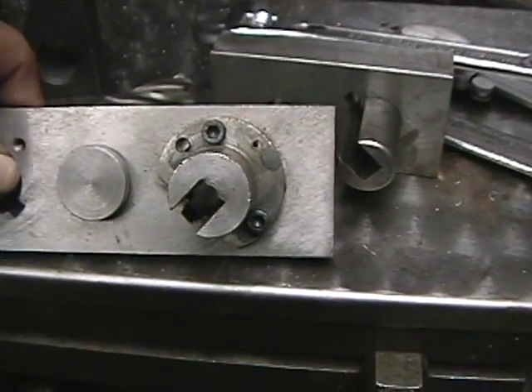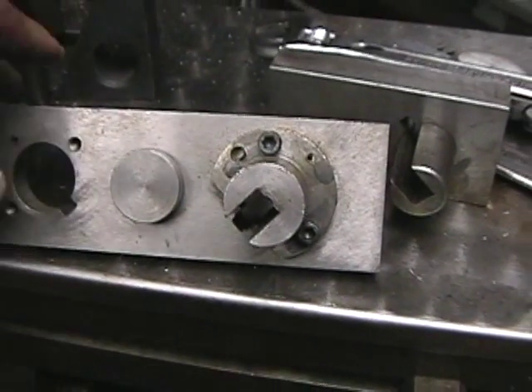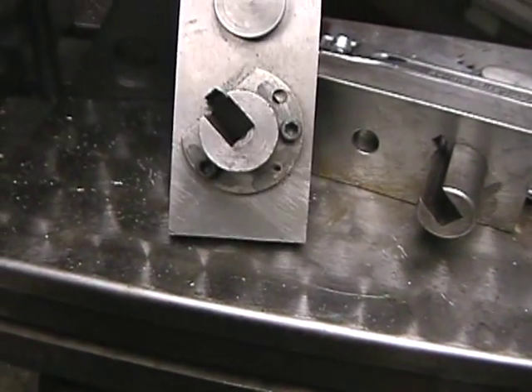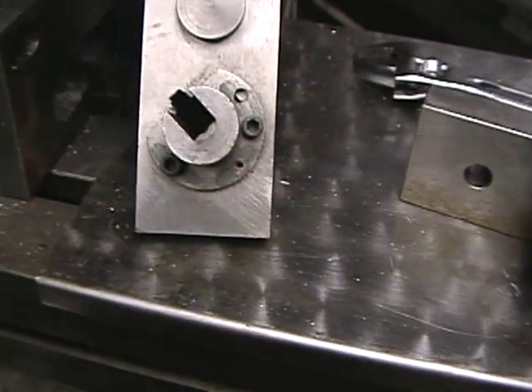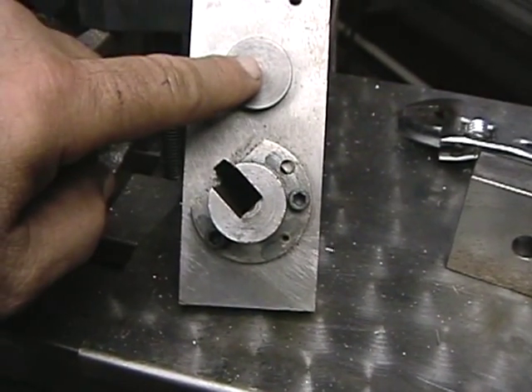There's been some confusion over the broaching jig for making the keyways in the drivers. I have always used the 45-degree method. Somebody said, 'What the heck is the 45-degree method?' Well, what it is, is cutting the keyway at 45 degrees to the crank.